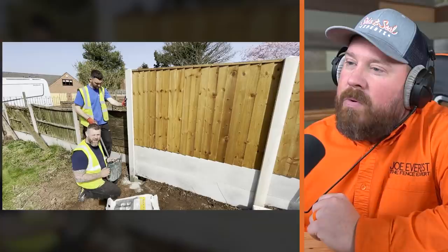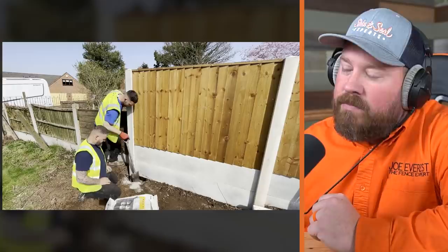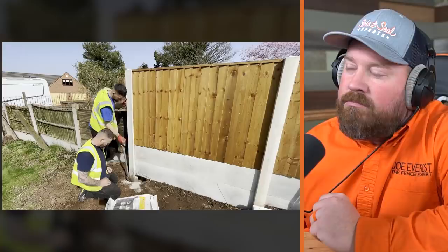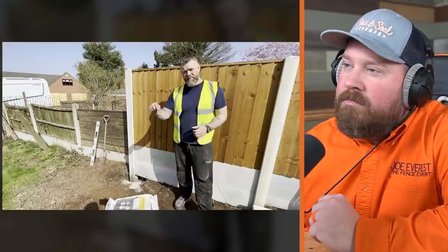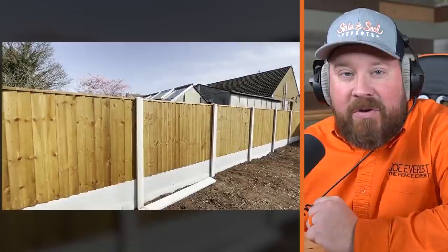It does say on the bags: two litres of water. On a hot day like today — because it is absolutely scorching — two litres of water is just right. Stevie's just agitating the hole, making sure the postcrete's well mixed in. One post in, ready and set. They left the concrete below grade and backfilled with dirt — a process I like seeing because then the grass will seed around the post and it'll be a nice finished look.